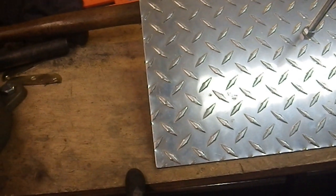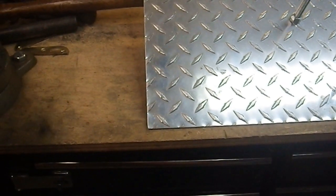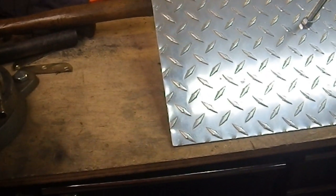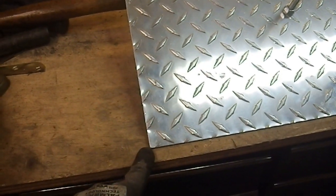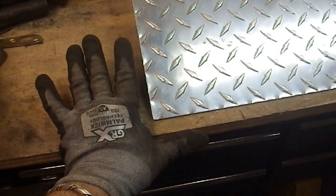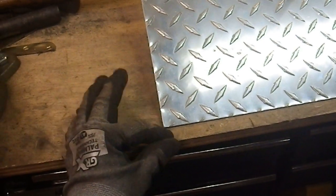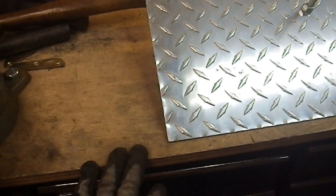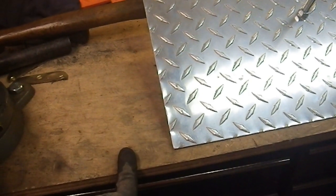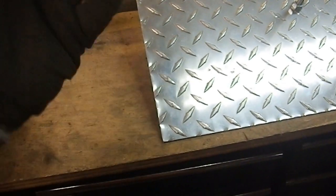And if I can, yeah, I can't really do that, can I? I would like to get them to reinforce each other at the corners. So what I might do is have reinforcement at the corners where you can't see it, make some L brackets, and have the L brackets going this way on the two pieces, so that each corner is held together. This and this will come together this way, as well as being bolted to this, because I don't want the things to separate. A solid piece that is held at each corner is going to have greater strength, so I'll probably do that. And I'll probably put those L brackets on the inside just because of aesthetics, you know what I mean?